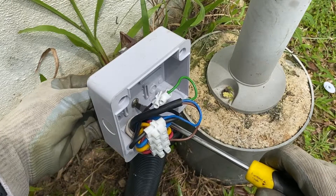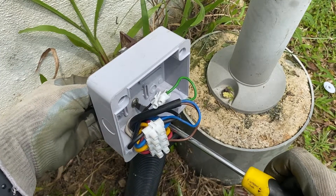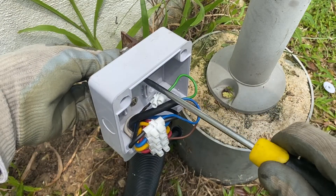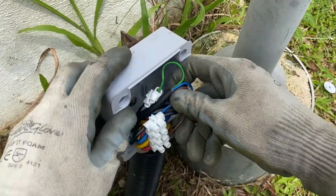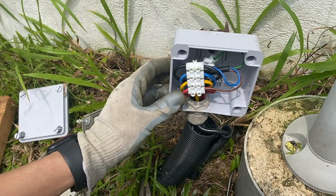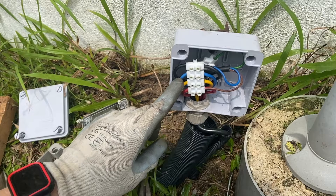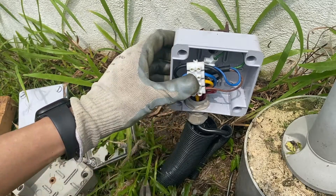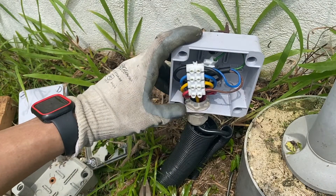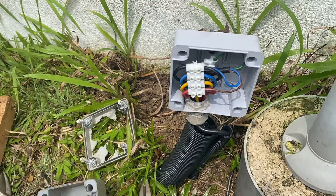Then I'm going to connect the M5 square nut to secure the junction box into place — one down there, another one up here, and then I'm done. I just need to push the wires inwards. I've reconnected the wires: red, yellow, blue — all three are live three-phase wiring. I installed the cable gland, secured the box, and tested — there is current coming in. I'm good to go.